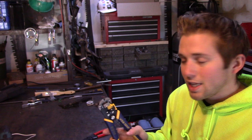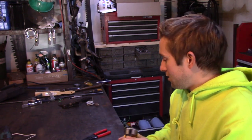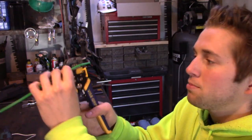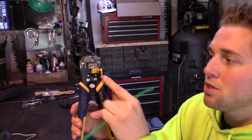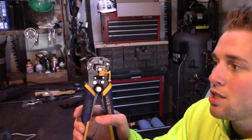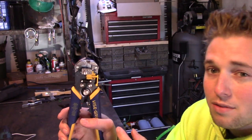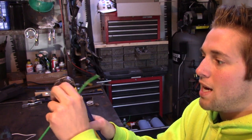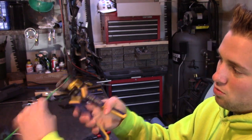Over time you may notice that this may not strip wire as effectively as it used to. I'm going to tune this thing down a little bit and show you what I mean. Now I'm going to try to strip this wire and it's not stripping it. The reason is because I've detuned the tension on this tool. You can retune the tension with this little knob right here — twist it all the way to the left for a very light grip, then start twisting to the right. And there we go — we're right back to where we should have been.